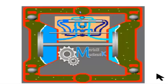Now going a little bit further, through the air distribution unit, air is distributed to the back side of the diaphragm, alternatively on either side of the diaphragms. So let's assume that the air is being pushed into this unit. The diaphragm moves out so that the other side of the diaphragm moves in, creating suction, and here the discharge happens as the diaphragm pushes the fluid out. Here you can note the balls, four in number, which act as valves, and here are the valve stoppers. Here is the valve seat.